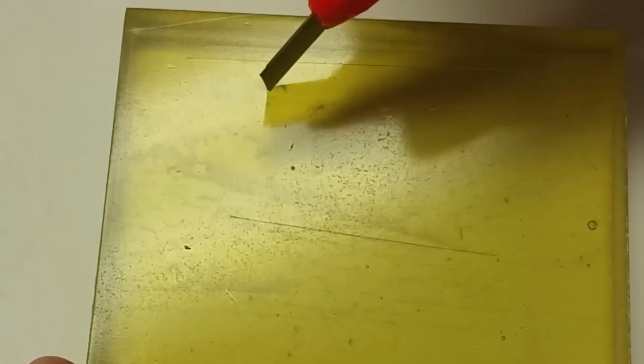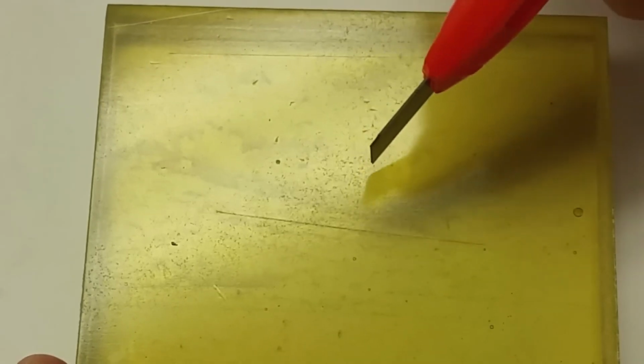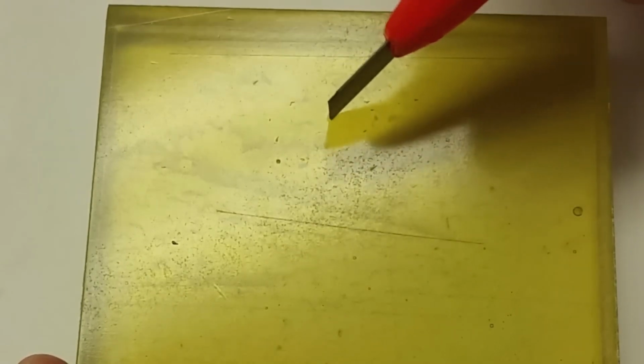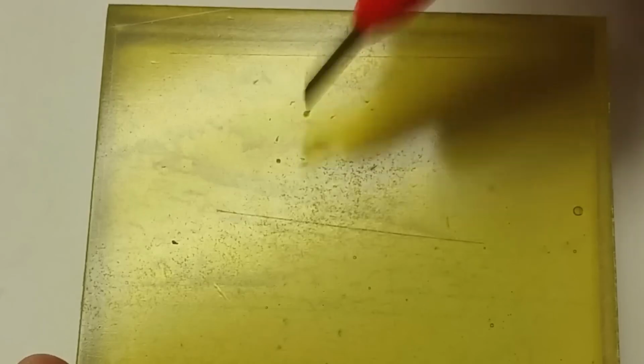The good thing about urethane is that when you cut into it with a die, the urethane will come back together to fill the knife cut instead of rolling apart and creating a void. This increases the life of your roll and will save you money on maintenance in the long run. Our urethane allows you to run any type of rule you want without damaging the roll.